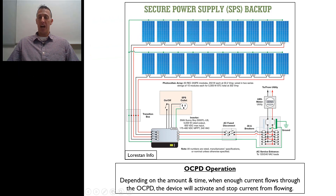To give us a better understanding of how an overcurrent protective device operates and how it shuts down and prevents things from being damaged, let's look at where they're placed within a solar PV system. Here we have a solar PV system with our array up top with all our modules. All the circuits come down into this inverter, which converts DC to AC and pushes it back through an AC fuse disconnect, then into the panel and out through the meter back to the utility. An overcurrent protective device can be located in multiple locations — you can see overcurrent protection, probably a fuse, located with each circuit inside the inverter, possibly in the AC disconnect, and also in the panel.